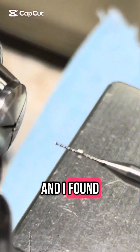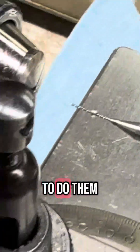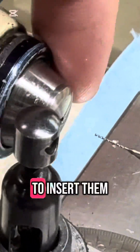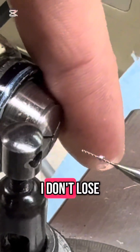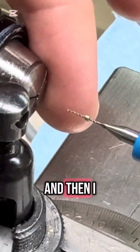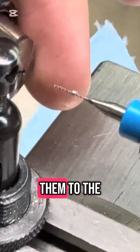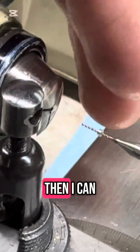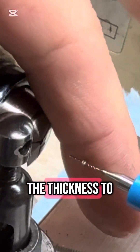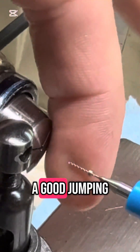I'm working on the weights and the best way to handle them is to put them on my drill bit and insert them into the collets so I don't lose them — I've dropped them quite a few times. I use my dials to turn them to the exact height, then mount them to a brass arbor to fine-tune the thickness and make sure they're all identical. This is a good jumping off point.